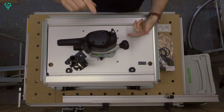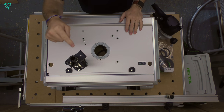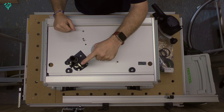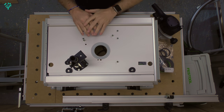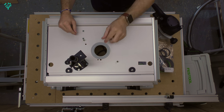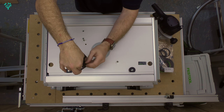Next, make sure your router is plunged down and that's locked off. With the router done, you now need to turn your attention to the lift mechanism. You can see there's a metal tab here. If you're using the OF-2020, that stays in the vertical position — that's where it comes packed with the kit, so you don't need to make any changes for the OF-2020. If you're using the OF-1400 or the OF-1010, you need to remove this metal tab.